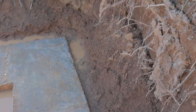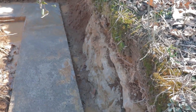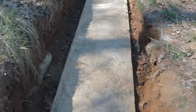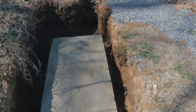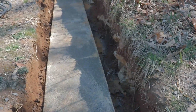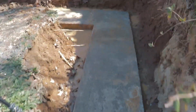I'm considering not even putting in perforated drainage pipes — it just seems like overkill since the water never rises high enough. Basically I'm going to fill in the edges with three-quarter inch gravel instead of dirt. I'm also not going to use any filter fabric along the edge of the trench, because with the clay-rich soil I have here, clay actually clogs up that filter fabric so water can't even get into the trench. If you have very clay-rich soil and you're doing a rubble trench, I usually don't recommend lining with filter fabric.